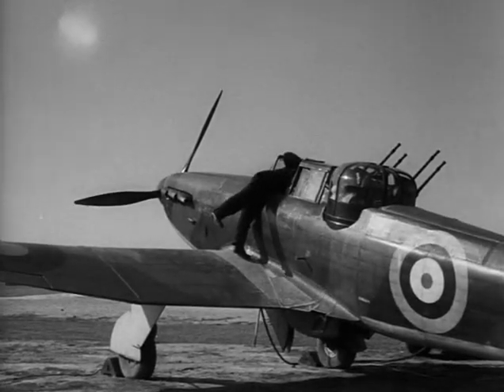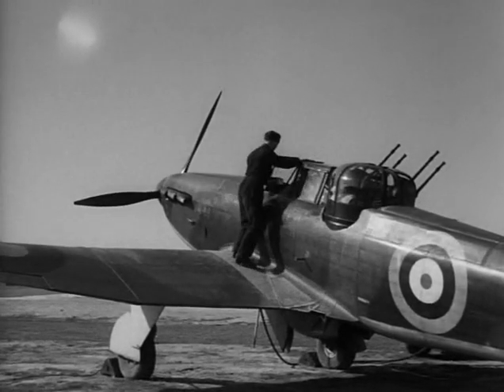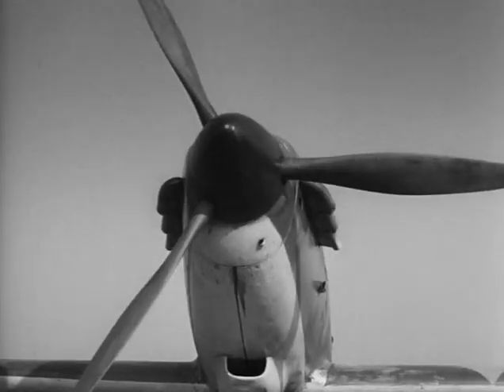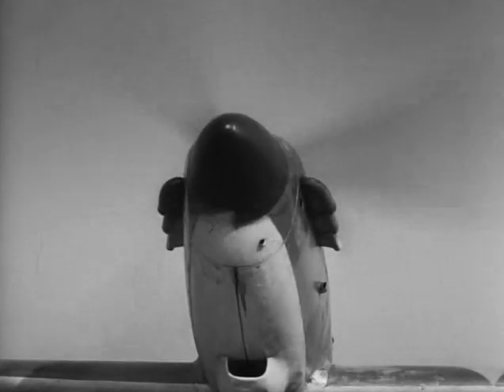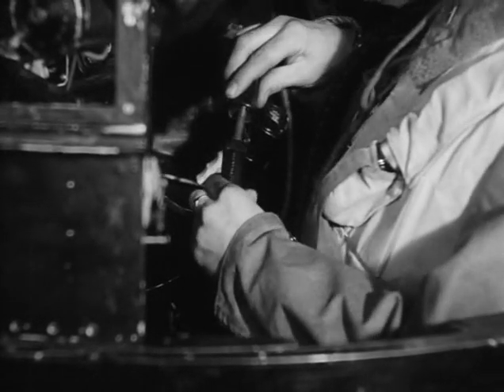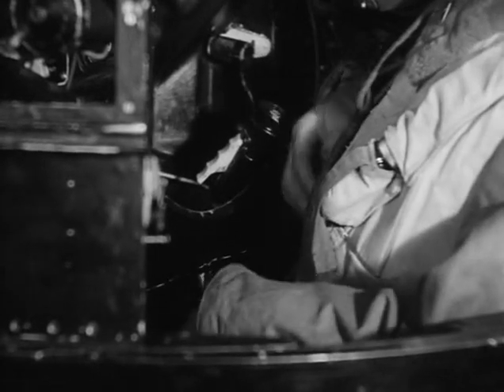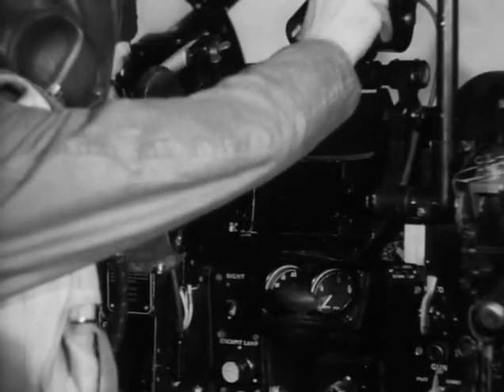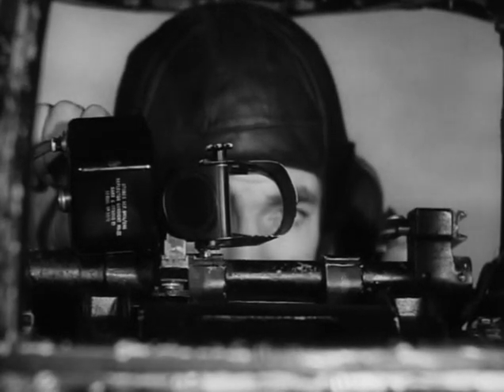Success with your firing in a two-seater aircraft depends entirely upon the teamwork of gunner and pilot, and the strictest attention to every detail is vital. The experienced air gunner follows the routine as a matter of habit. Observe his actions: he plugs in intercom, ensures that the free and engaged lever is in the engaged position.